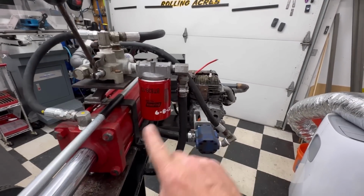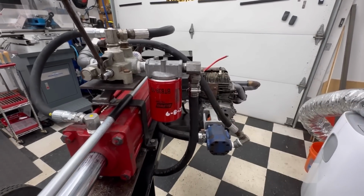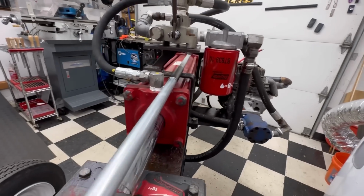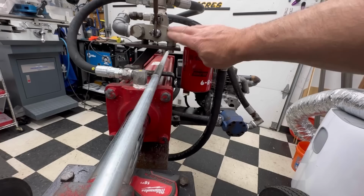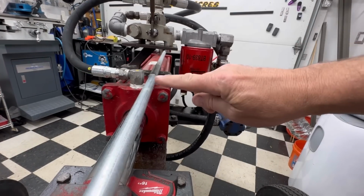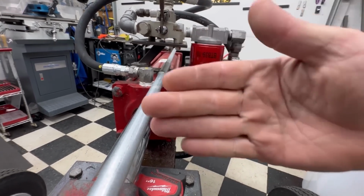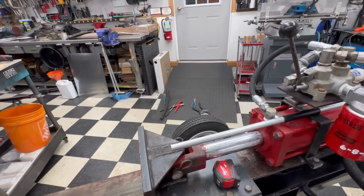So over here, I would have had a long arm sticking way out to try and reach that. And I had the gas tank and some other things to work around. This way, like I showed you, it's free and clear now underneath the valve. So this thing can slide back and forth. I'll put a stopper on it. It bumps that and it stops my return stroke. I just need to make up some mounts to go on there.